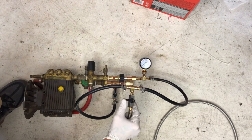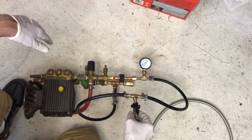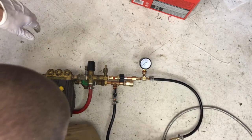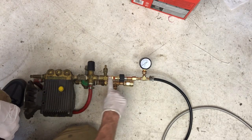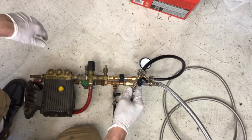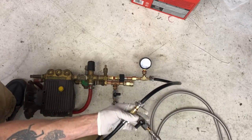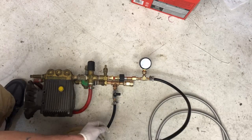In this particular case we're going to be running a mono-tube steam pressure washer. To adjust the pressure: if this valve is completely closed, all the pressure coming out of the discharge is forced out to the mono-tube boiler, or to whatever you want to provide pressure to. Let's say you want to pump some high-pressure oil at a very low flow rate but you can't find a pump to do it.